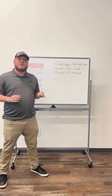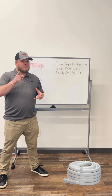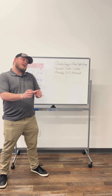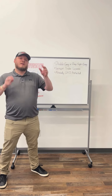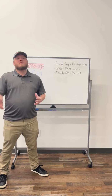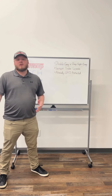The second thing that we always recommend is that the sensor probe that comes with the thermostat — make sure the sensor probe's in your box when you get your thermostat — runs in a separate conduit from the cold lead tail that runs up from the floor up to your thermostat. If they're in the same conduit or are touching, there is a chance that you might have some bad readings on your sensor probe, which could affect how your floor heats.